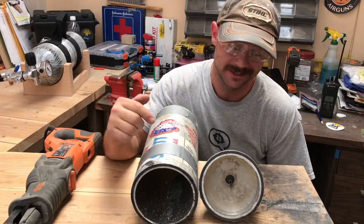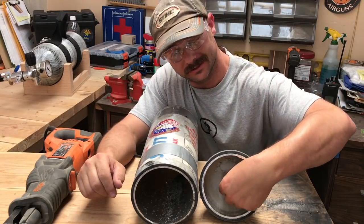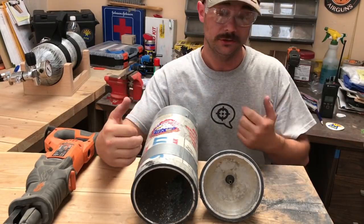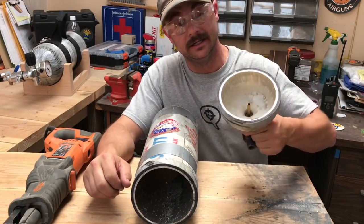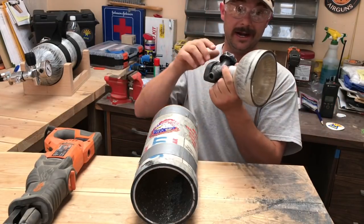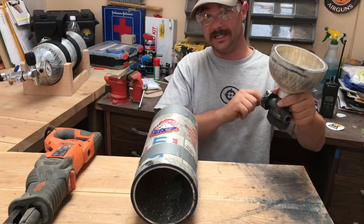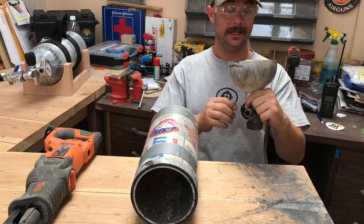Here you go guys, this is what's inside an SCBA bottle. One thing I've noticed is this little straw here. So as air gunners, if we get moisture in our tank and we're using SCBA, we may not know it, because the straw is grabbing usually this way. But even if you tip it upside down and try to bleed out that water you suspect is in there, you're not going to — not unless you have a lot of water in there.